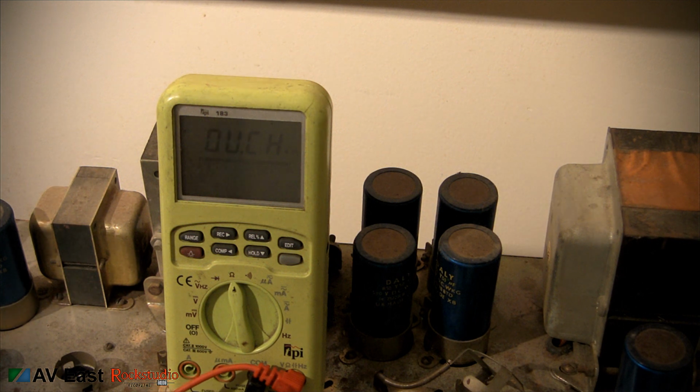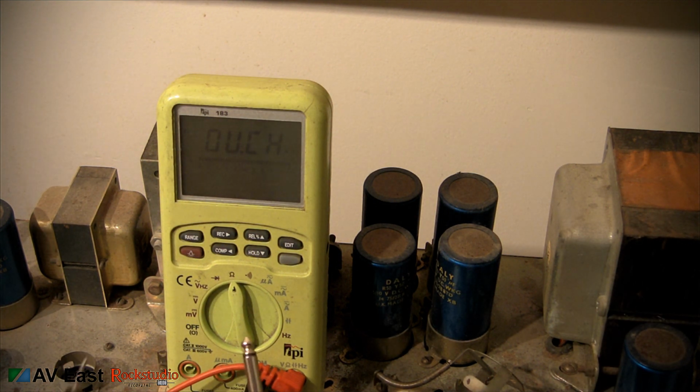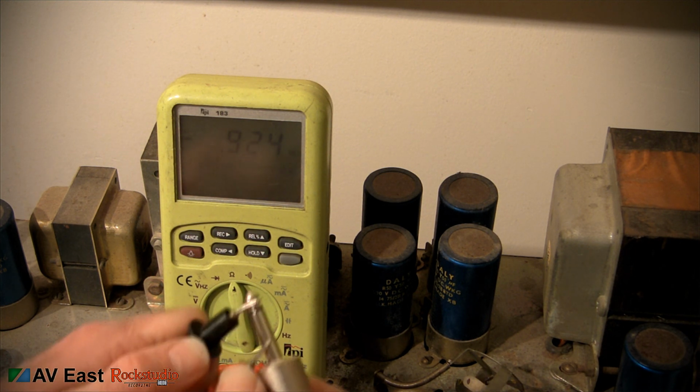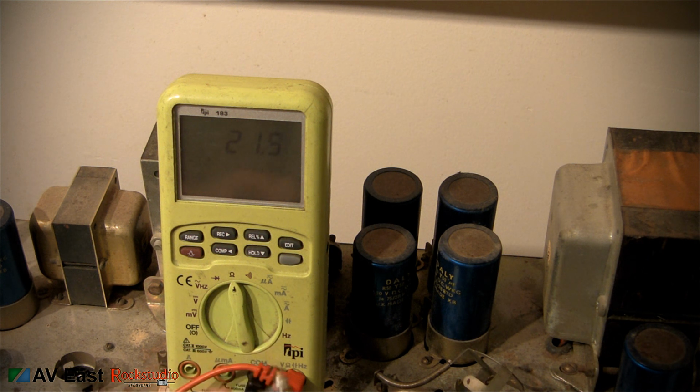As you can see, I've removed 2 of the output tubes from my Marshall. I do this so I can have lower volume. And the trick is that you can remove them, but you have to change the impedance also. For instance, if you're running into a 16 ohm speaker, you have to set your impedance jack on your Marshall to 8. If it's an 8 ohm speaker, set your impedance selector for 4 ohms.